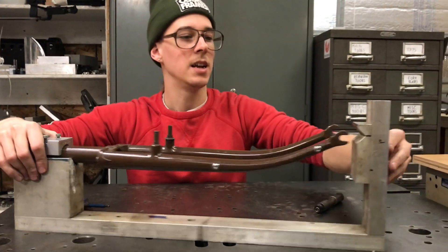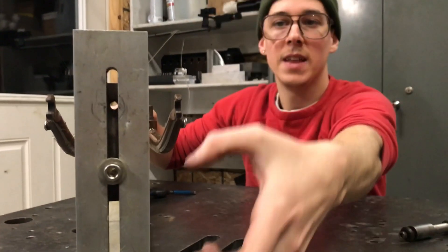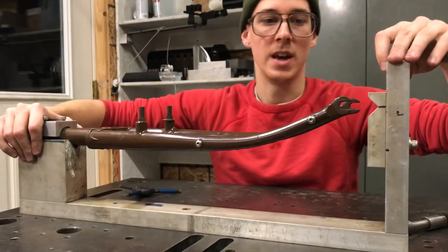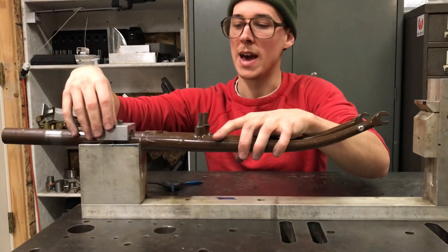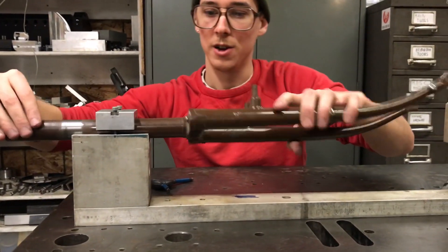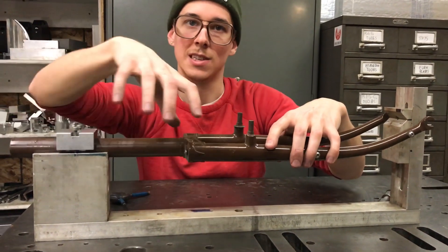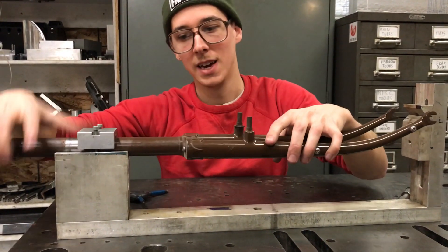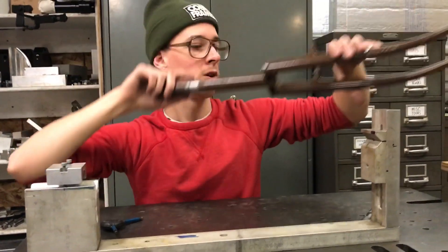It's not the most sophisticated. Back here you have a screw — loosen it and you can slide this block up and down. It's very simple. If you have a longer fork, the crown is going to be closer to this back block; if you have a shorter fork, the crown is going to be further away. This whole assembly doesn't slide along a scale, it just stays put, and that works pretty well for the kinds of forks I was making.